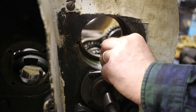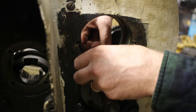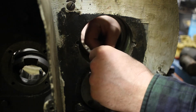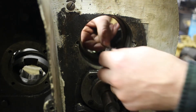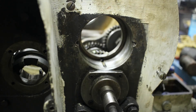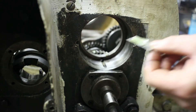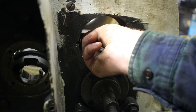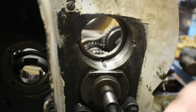Well, no huge surprise — that was a failure. I didn't really think that was going to work, but I was hopeful. I think there was just too big a layer of Loctite, and it set up too much. I thought that perhaps the Loctite wouldn't actually set up and would still be liquid, but I think with the heat and being such a thin layer, it sets up very quickly. It says an hour working time, but I believe that's an hour working time before you put the two sleeves together, because those flakes are pretty thick and pretty hard.